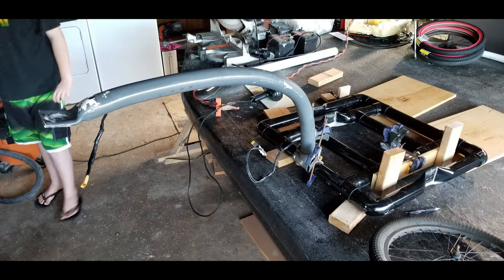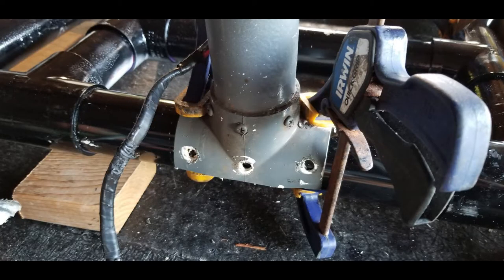Now it's time to attach the connecting arm to the trailer base. I did not build the T connector into the base of the trailer because I wanted the option of exchanging it in case something went wrong, or removing it if I needed to run wires. As seen on other channels, you can use screws to put pieces together if you want to be able to reuse or remove them. I've cut off the bottom of the T connector, heated it a little with the heat gun so it could open up, and slipped it over the two inch black pipe. Make sure the pipe is vertically positioned properly so it'll connect to the bicycle at the right angle, then drill three holes and insert bolts with washers and nuts on the other side. This allows removal later if the connecting arm breaks or needs servicing.